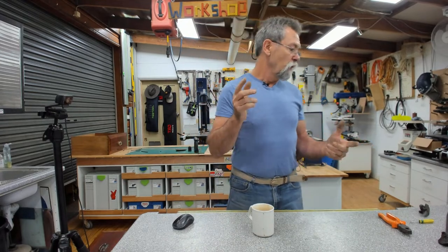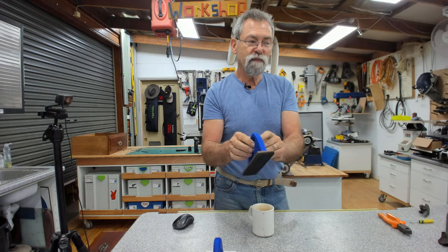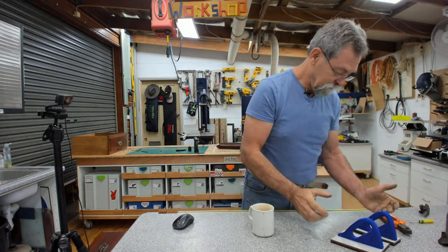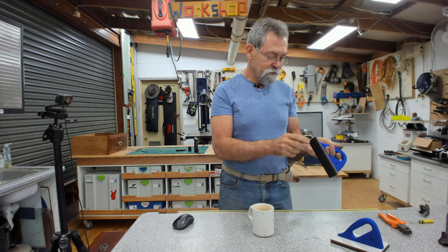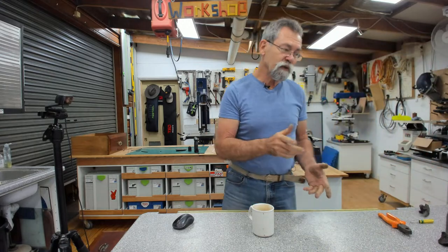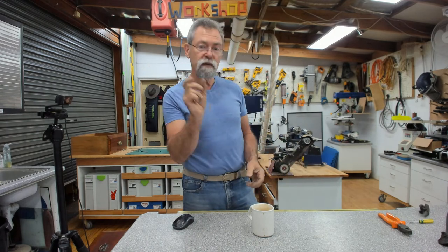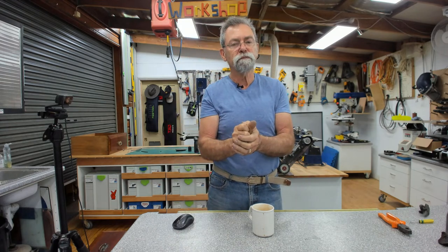I think the show's done. We've shown you the Gifkins jig push blocks. Now, I don't know if Cole is going to put these on his site. I think they look great, and I would jump in and get some. I think this one's so clever, offset at an angle like that. If I hadn't had them sent to me, I would possibly buy one. I'm not telling you to race out and buy them. I'm just saying I've looked at that, and there's many times that I've pushed stuff up against the fence on the router table and also on the jointer, where that would have been great for the narrow stock, rather than have a large push block hanging off the edge and possibly rocking while I'm holding something down.